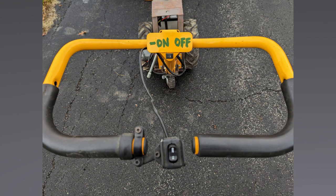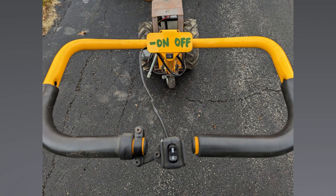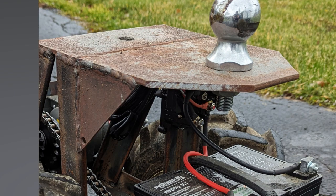No video of this install, but I want to mention the last technical hurdle: getting the control system set up. The winch comes with a really crummy controller, but I wanted a system that lets me keep two hands on the handle for safety when dealing with heavy rolling loads. I installed an aftermarket solenoid and winch controller — just an ATV-style controller from Amazon, about $30. This gives me a thumb control for forward and backward. I also wired in a full on/off battery cutoff switch to prevent any leakdown. The solenoid and wiring are mounted underneath the tower, below the trailer ball.